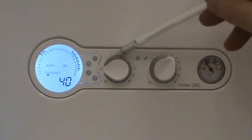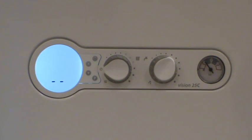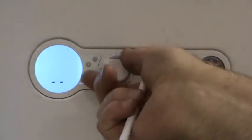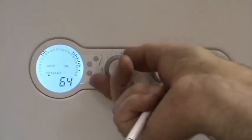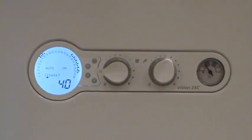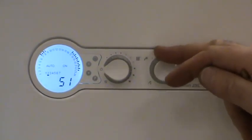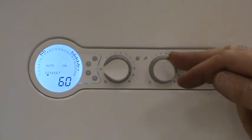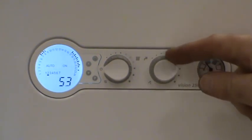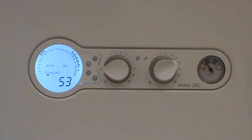This selector is used to decide what temperature you want the boiler water to enter the heating system — usually people will set it at about 75 degrees. When it's moved, it will actually tell you on the display what the target temperature is. The hot water selector will do the same: as you adjust it, it informs you what your target temperature will be. When hot water is running, it will display the delivery temperature.